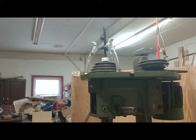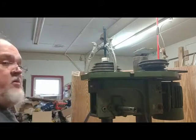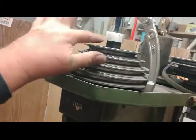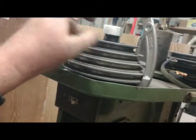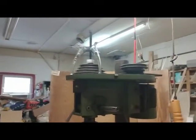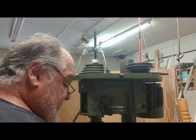It took a minute to get the puller set up, but what I did is I used the biggest jaw set I had and went all the way to the bottom. The center post was bigger than the beveled end of the puller, so I used a piece of HDPE that I use to make stuff on the lathe — and I already had a nice center point in. Let's see what happens.